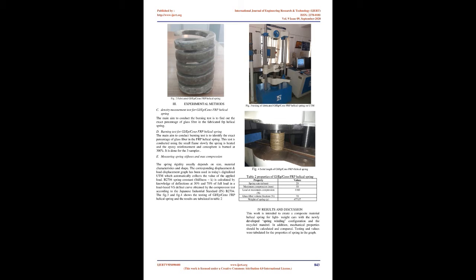Fabrication: The composite helical spring was produced using a prepared reusable mandrel, a developed spring winding setup, and selected materials. The reusable mandrel is fixed between the centers of a lathe, with a profile similar to the appropriate helical spring. Silicone gel is smeared evenly on the mandrel surface for quick removal of the spring. Continuous glass fibers from bobbins are dipped in a bath of epoxy resin and wound on the mandrel. The estimated volume of epoxy resin and cenosphere is mixed with a K6 hardener at a ratio of 10:1. The winding process continues until the necessary dimension is obtained, then the mandrel is wrapped with a shrink rubber tape to avoid atmospheric contamination. The spring is left to cure for 4 days.